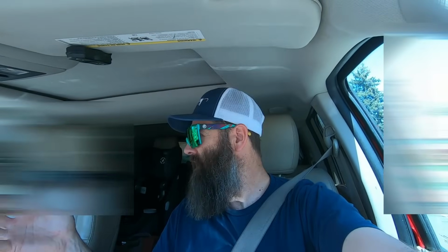So the symptoms of the house I'm going at: water underneath the kitchen sink. That's the symptom from the garbage disposal area. Could be anything from a slip joint on the drain line came loose. Hopefully it's something simple like that. Get in, get out, get paid.